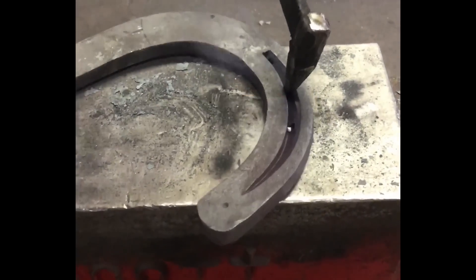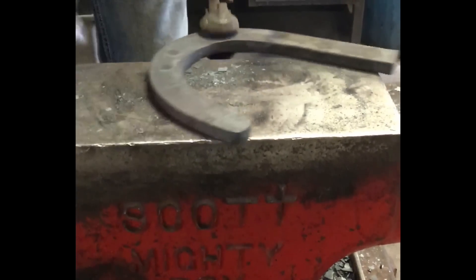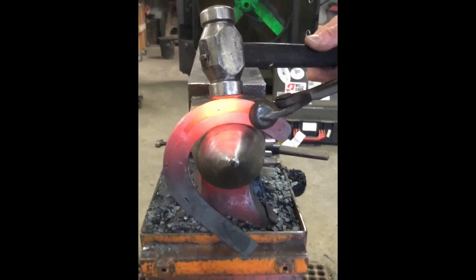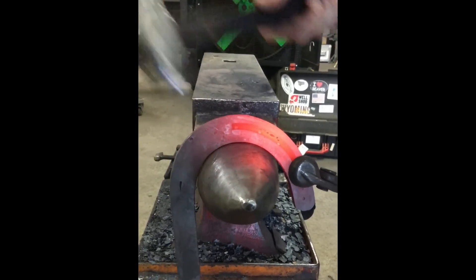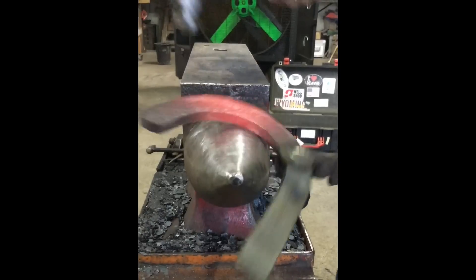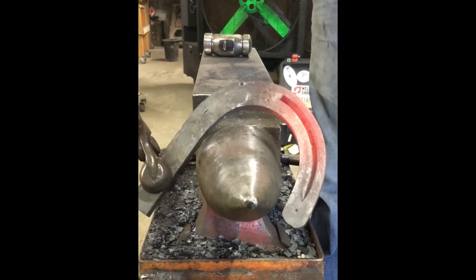Split the difference. Now I'll come in here and get a little boxing. I have the heel nail here, so I'm cleaning up that back edge and getting these big bumps out of the toe, going right through the toe clip. Then I find the heel nail again and move away from it in this direction — what that does is give me the arc going away from the heel nail the same as the arc going away from the heel nail going into the toe.